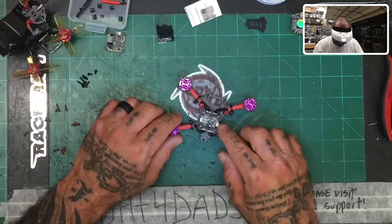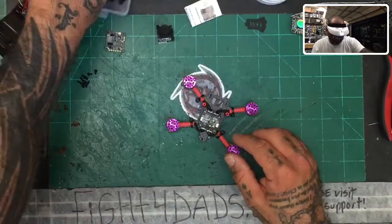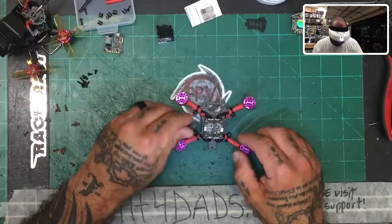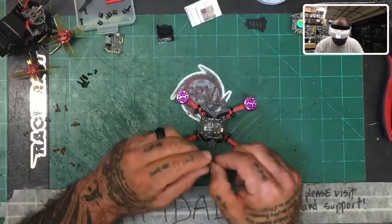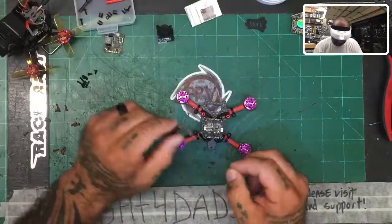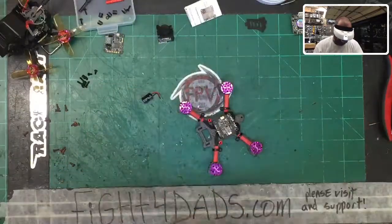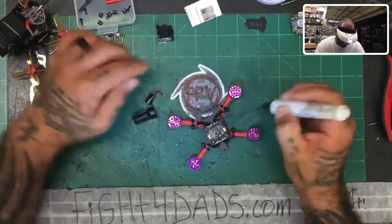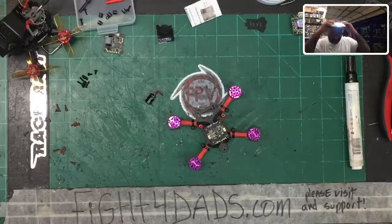Looking here, what we need to do is pick our sides for the capacitor, which is this right here. We'll also have our LiPo connector — I may use the JST; I'm really not sure yet. But let's go ahead and prep the board anyway. We'll go ahead and put our flux pen on here and get that ready.